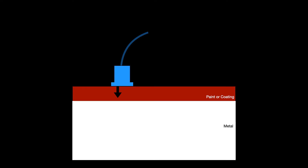Now I'll show the sound moving from the transducer just a little bit to the interface between the paint or coating and the metal. One handy thing to understand for this trick: at every interface or change between types of materials where there's a change in velocity, some of the sound will be transmitted and some of it will be reflected. At this interface between the paint and the steel, some of the sound bounces right back toward the transducer — we don't care about it, it'll be buried in the initial pulse and it's not useful to us.